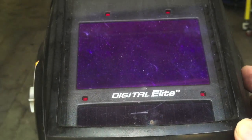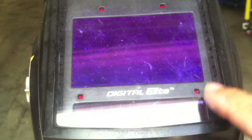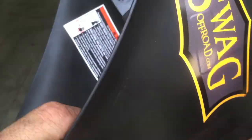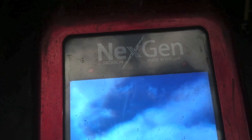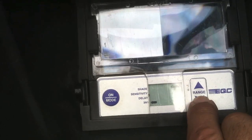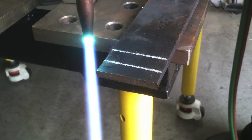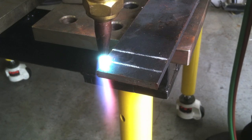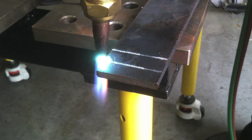You should have proper eyewear. I like to use an auto-darkening welding helmet — I have a couple with a cut-and-grind mode. This is a Miller Digital Elite with four sensors. I can keep my cheater magnifier lens in there and set it to shade 3 for grind mode or shade 5 for cut mode. For really thick cutting I might set it on 5, but shade 3 is sometimes good for cutting.